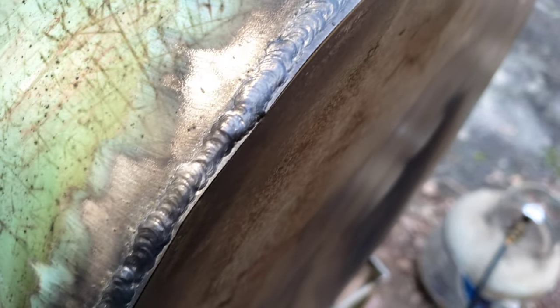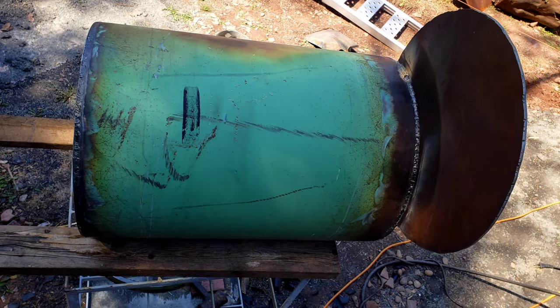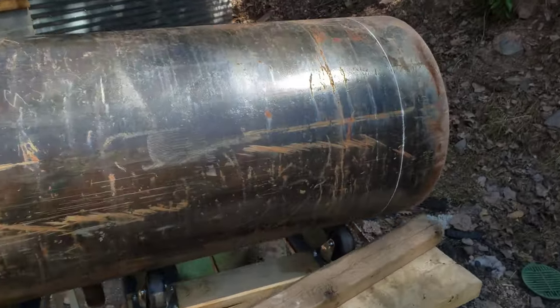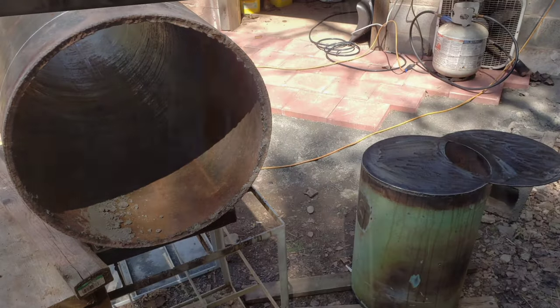Now that I got it shortened to about 22 inches, I'm going to get this welded up. This is the firebox door side. Got that welded and cleaned up. And now I finally got the firebox cook chamber side welded on. I'm going to get this shortened up — taking 4 inches off. You can see I already have it marked. We'll get that shortened up and capped off.